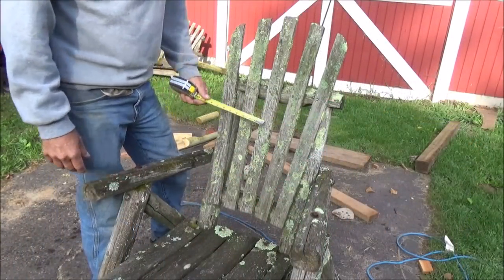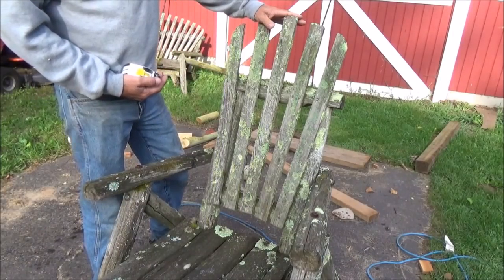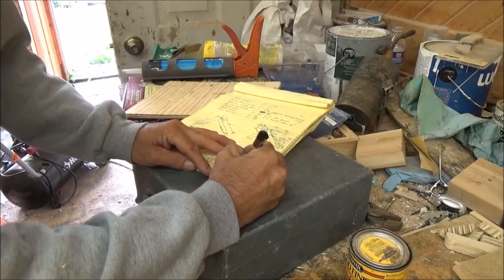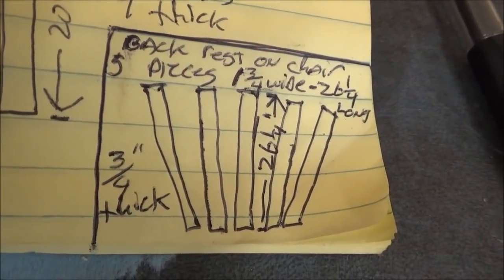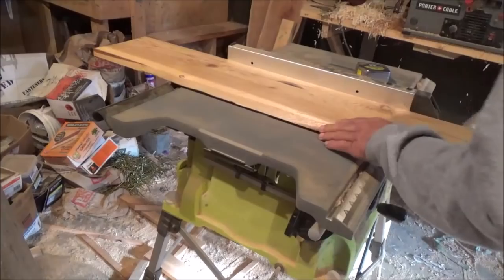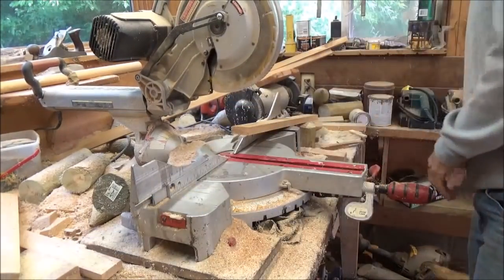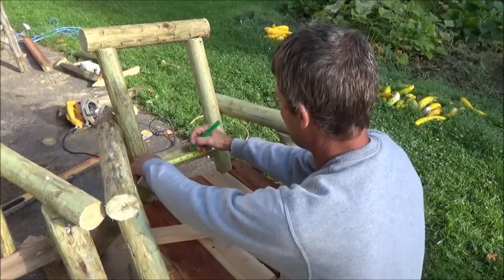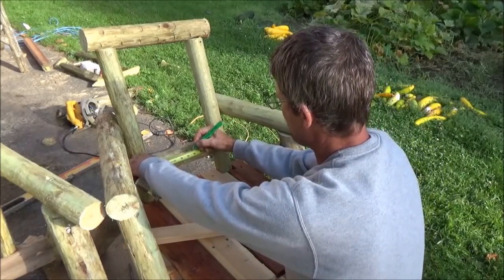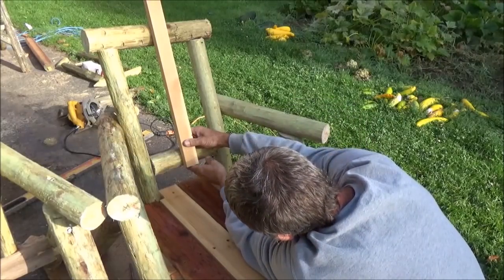For these back pieces here, just like on the bench seat I made, they're inch and three quarter wide and the longest one here is twenty-six and a quarter. I'll go ahead and cut the center one square and probably cut them all like this, then just buzz these off after they're already put on to the chair. When we do this upright, we're going to cut the center one square — find the center, which is nine and three quarters, so it's four and seven eighths. Then we want to come over, because this is an inch and three quarter wide, so we want to get to one side of it, which is seven eighths of an inch over. Once you get it set here, put it about flush on that one there.